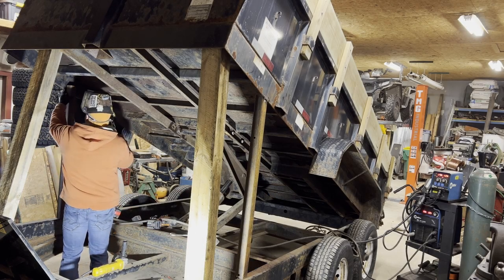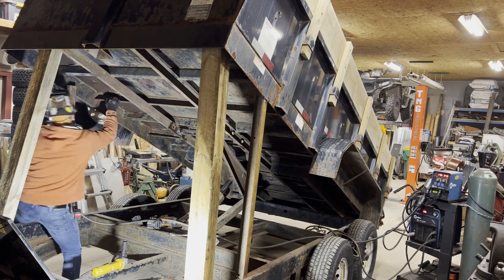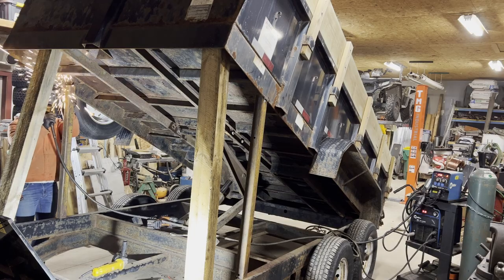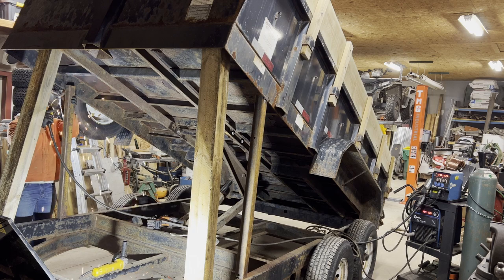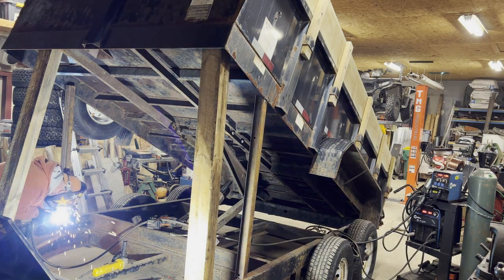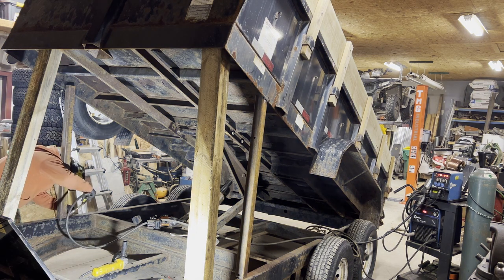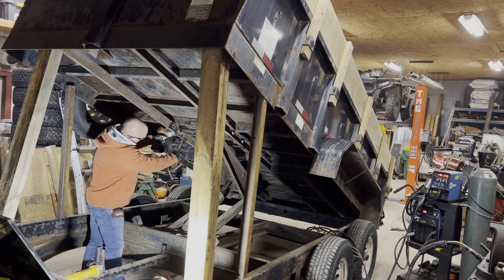After I was able to get the shaft out of that scissor lift collar, it was a 2-inch inside dimension collar. I was able to clean everything up, polish it all up, and then weld the plates back to the shafts and then put them all back in. As you'll watch, throughout most of this video, I have most of the commentary in the video itself. I'm just doing a voiceover right now because of the initial videos that were taken. The sound was very muffled, so.